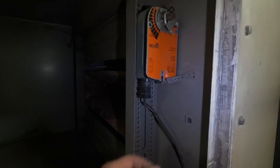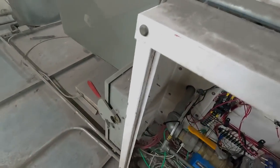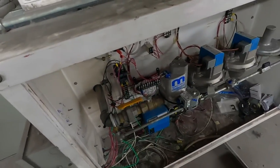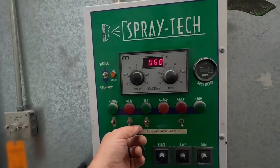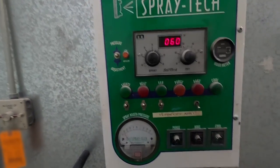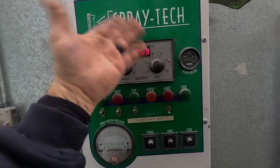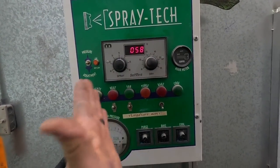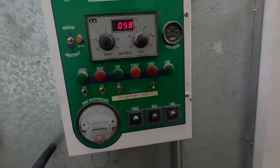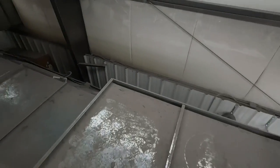We've got an issue with it not firing every time. Let's kick that on. Honeywell's coming on. We're going to turn on the heat — it should light up, I hope. Let's go see what the dampers are doing. Bake is on and off here. When you flip on bake, that brings the dampers to the vertical position. Let's see where it goes. We're locked out — go ahead and reset it. See if we can get over here to the pilot, see where the dampers are at, see if they're backwards.